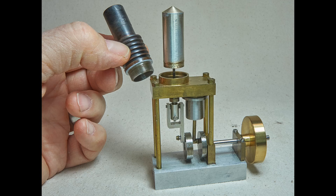The displacer connecting rod is forked, as you can see in the photo, so that some of the side loading on the displacer rod — which is 1/16th inch diameter — occurs directly over or close to the gland. The connecting rod is machined from aluminum and fitted with brass bushings. The main shaft is eighth inch diameter drill rod running in plain brass bearings.